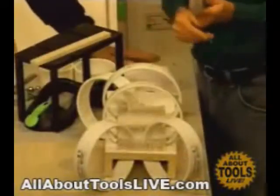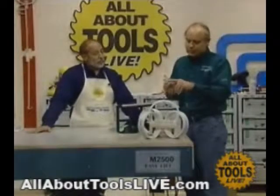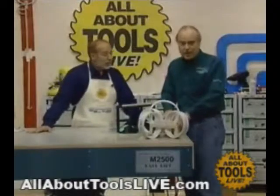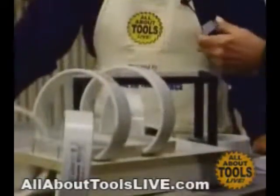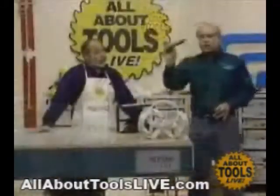Then you end up with a strip final like this, and you'll see the squeeze out on the back side. What happens on this rail is that you'll have squeeze out. You'll need to hit it with a file, run it through your table saw, and then you'll end up with sticks like this to put on your deck.